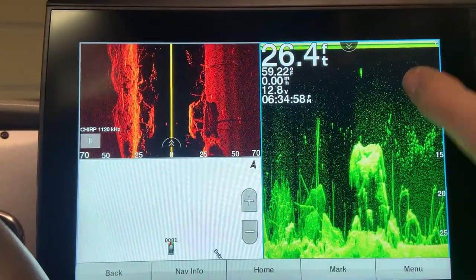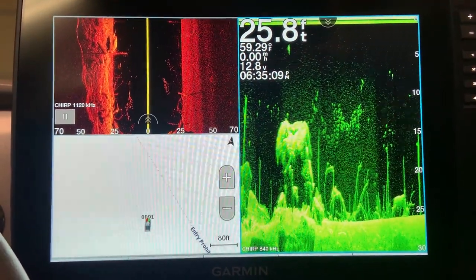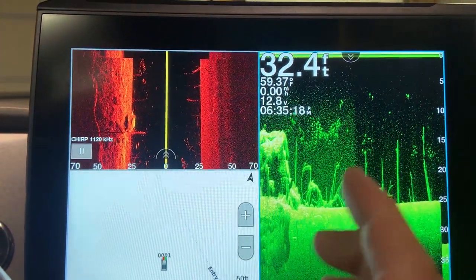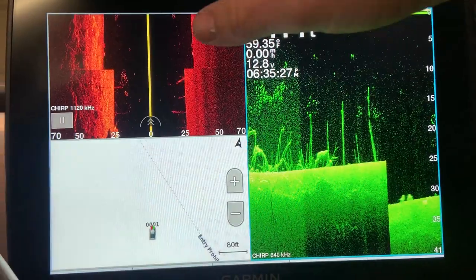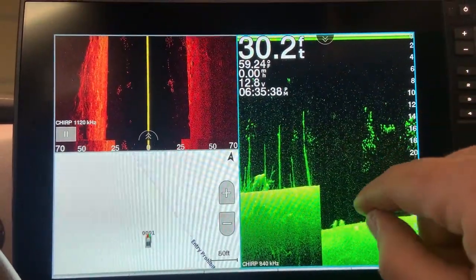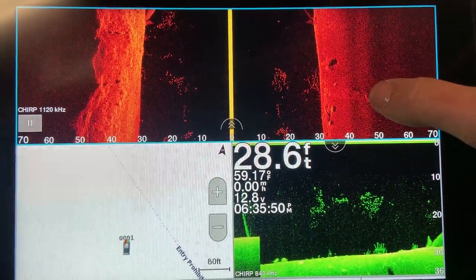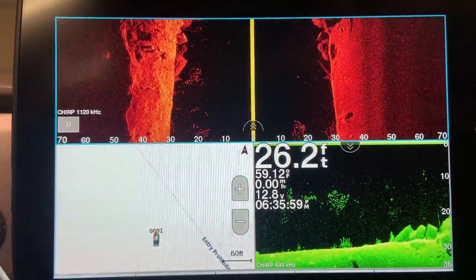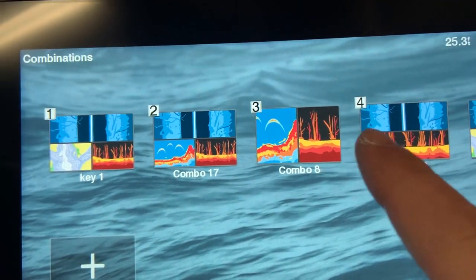This layout has side imaging, down imaging, and a map — a very typical layout you see all the time. But if you want to get the most out of side imaging, this is why this combination is wrong: we have 70 feet on each side — 140 feet of information — being compressed onto a very small portion of the screen. The fix is to run your side imaging all the way across the screen. With one of my preset combinations you can instantly see much better resolution, more detail, and you can actually pick out what things are much more easily. So I always run side imaging across the full screen.